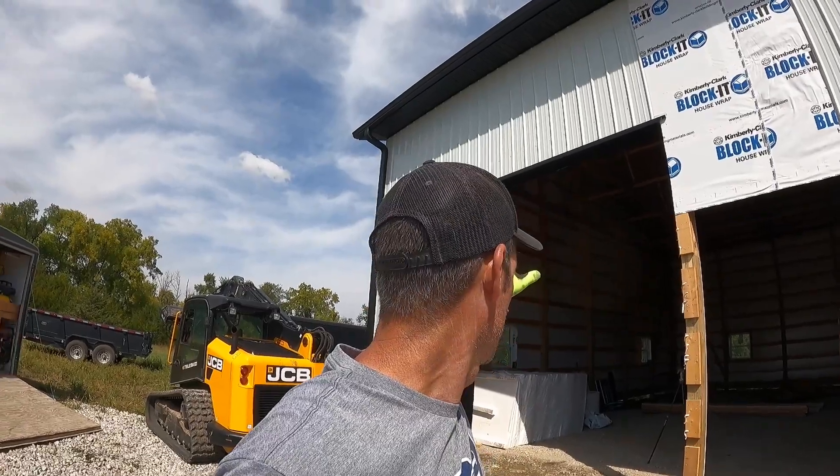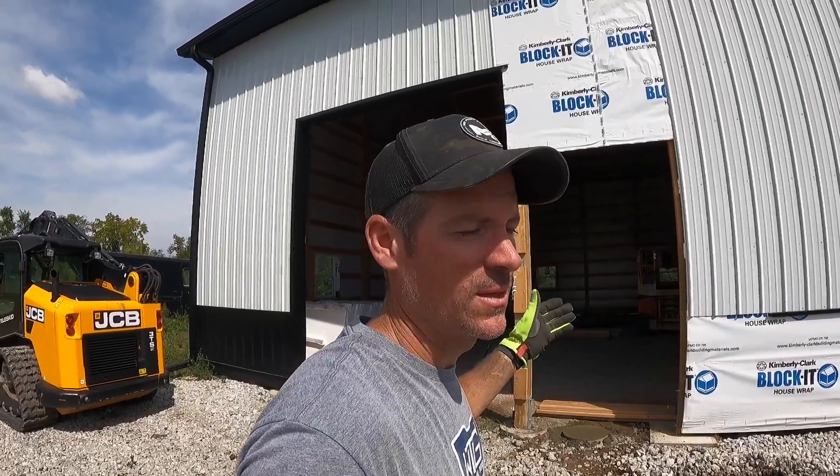I can get that header off and get a new one in, but I'm going to leave it for now because it'll probably be about a week before I get back here. So that's going to be a wrap on this video on widening a post frame garage door. If you are willing to buy another column and leave a column in place while you pour your other footing, this is something that can be done without affecting your roof or taking any chances of it sagging — it's just going to cost you money for another column, another footing, some longer trims, and the time to do it. As always, we appreciate you watching — hit that subscribe button, share with your friends, and we'll catch you on the next video.